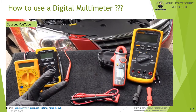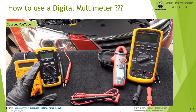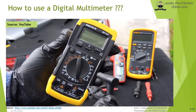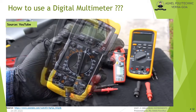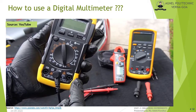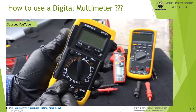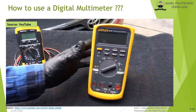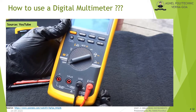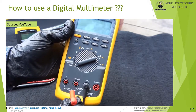There are two types of multimeters: manual-ranging and auto-ranging. Every multimeter comes with at least two leads — one red and one black. The black lead always goes to the common jack. The red lead goes to either of the other two jacks depending on what you're measuring: for volts, resistance, or milliamps, plug the red lead into the volt-ohm-mA jack; for larger currents up to 10 amps, plug the red lead into the 10 A jack. Different multimeters may have slightly different setups.